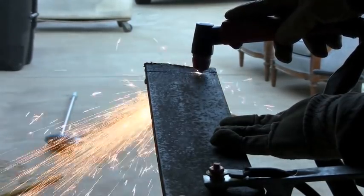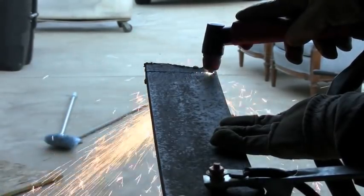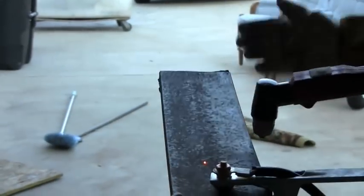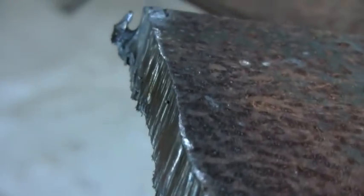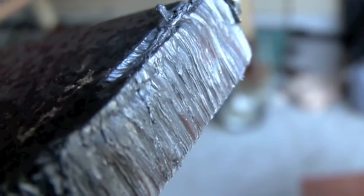It's pretty good — I don't have a line, I'm just freehand cutting. It still amazes me that I have a plasma cutter this strong, because usually they're out of my price range. Here's the cut I made with it. I should have had the air pressure higher, but that's as good as I'd do with a torch for sure. I haven't practiced with plasma nearly as long as with a torch, so I'll get it eventually. But that's thick material — I like plasma cutting.